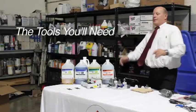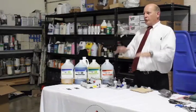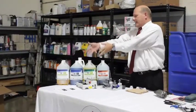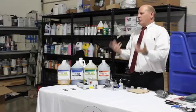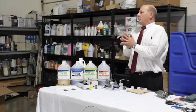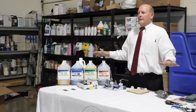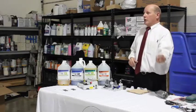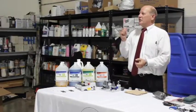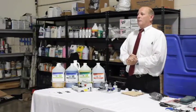The best way to set up a unit is to set it up before you get on site. I've done hundreds and hundreds — so has Daniel. I can set them up by taking a box to a job site, pop it open and do it. But anyone who's done a bunch of these knows you can do it 10 times faster and more efficiently if you set them up before you go out on site. If you have a work area like this with the tools handy, you can go through a setup of a dispenser in about 10 minutes or less. Then when you get on site, all you have to do is tack it onto the wall — that's about five minutes. That's a lot better than four hours.